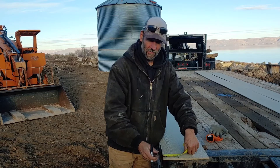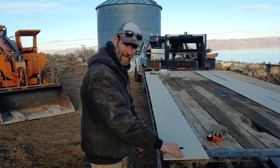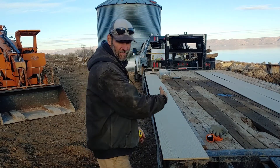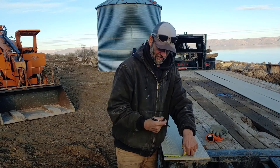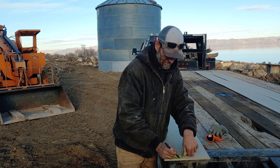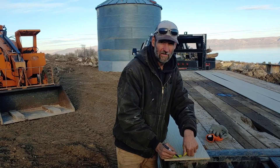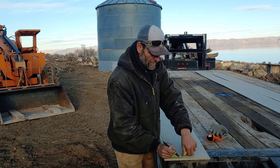I'm not using a chalk box because I know this piece of siding is not perfectly straight — it probably rounds up or down, I'm not even going to chance it. This is how I'm going to install this by myself, trying to wrap a 16-foot board around a radius, going up four inches.